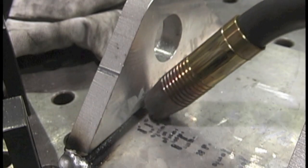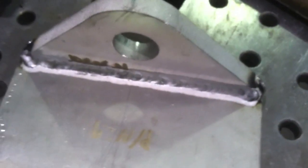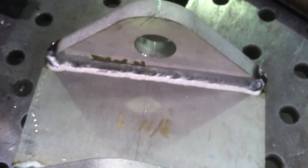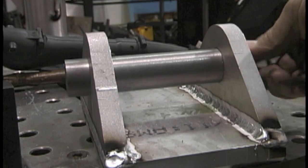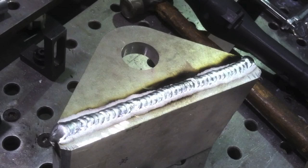Here I'm welding the outside of that piece — it's got a pretty good little V-groove on it. The reason I'm welding the outside first is because the inside will always pull more than the outside. So I know that if I weld the outside it's going to pull, but the inside is going to pull even more, and usually that sequence will let things come back to being pretty flat. That pin is loosey-goosey again like it should be, so it worked out really well.